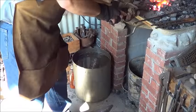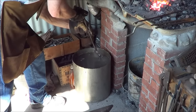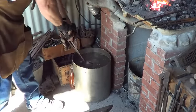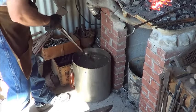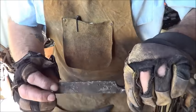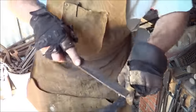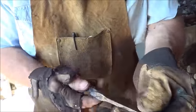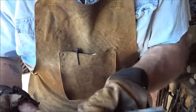She's up to temperature. We'll go ahead and give her a quench. Before it's too late, we'll take a peek to make sure she's straight - which she is. Finish the quench. That's the way we do it. I'll have to do some research on this one - I'm thinking this thing doesn't even need to be hardened, but here we are. I just don't want it too hard that there's a possibility it might break. Look at that spine - I doubt it's going to break for any reason.